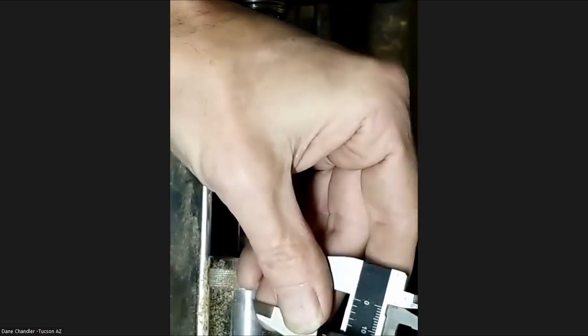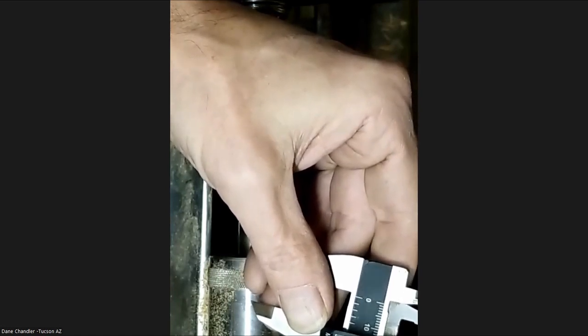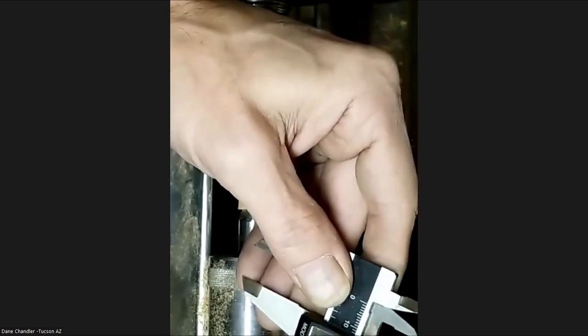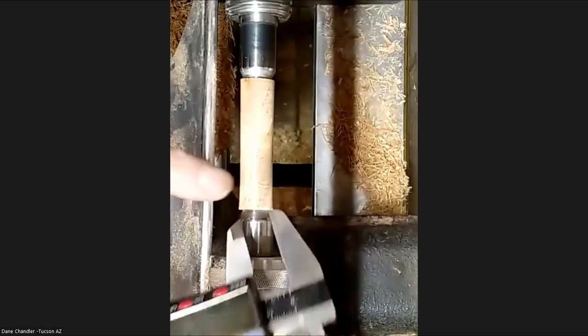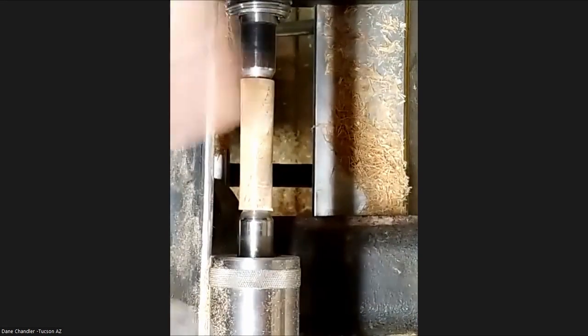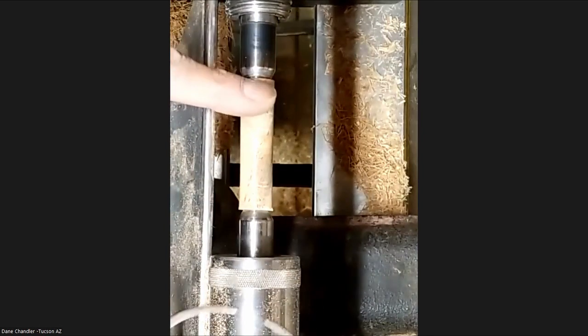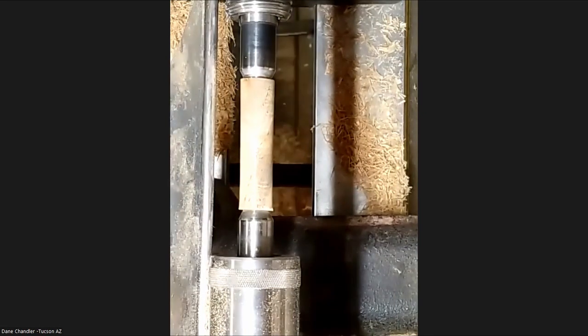And so we're going to go back, and if I was to do a pen, I would use CA. I want to be somewhere between 12.86 and 12.9, and that's what I'm going to shoot for here on the cap side. And then 11.8 to 12 for this side. I've already got my calipers set to include that buildup that I'm going to use when I finish a pen, because I make them with CA. All right, so does that make sense? Sounds like a plan to me.